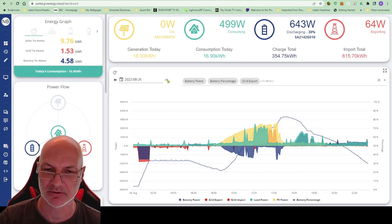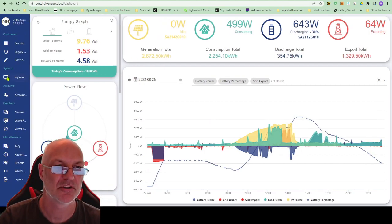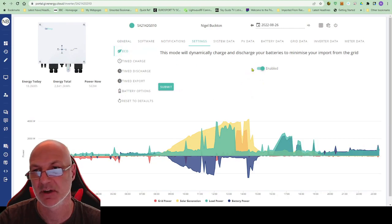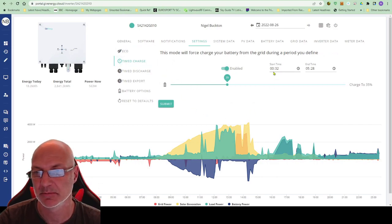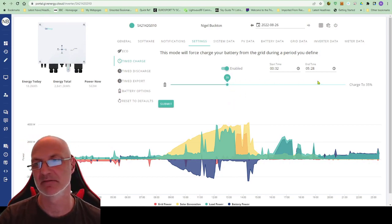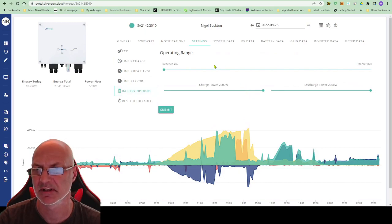I got it back on track — charged back up to about 30 percent and then did the same kind of thing. On the inverter I've set it to Eco mode so it uses the power I've got when I'm ready. I've set the time charge between 12:30 and 5:30, charging to 35 percent every night. In winter people generally set it to 100 because you're not charging your battery as much from solar. It seems to work better configuring it directly on the inverter than through the app.